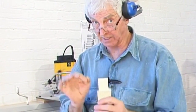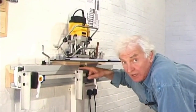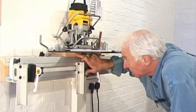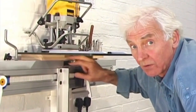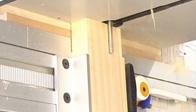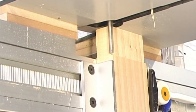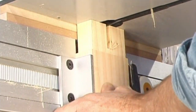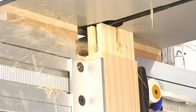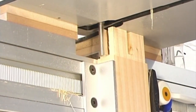The WoodRat is a tenoner. Ordinarily, we have a 1-inch depth of cut, but see that I've put in 2 raising plates, which will give an extra inch, and that means a 2-inch depth of cut, which is fine for most cabinet-making work. WoodRat tenons are quite straightforward. You can make the whole gang: stub tenons, double tenons, twin tenons and double twin, as well as simple laps and rebates.